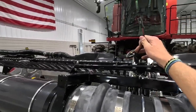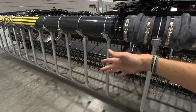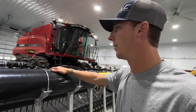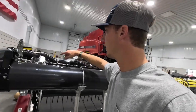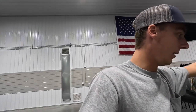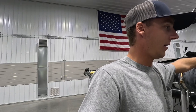We've got to hook up our harness here that goes in the cab so you can control your fore and aft for the air reel. We've got to mount a gauge over here and then that should be it. We might have to do some adjustments on the air reel - on both of these brackets on the right side, the left, and the middle. But we won't know until we get outside and shoot around with up and down on the reel and cutting height.